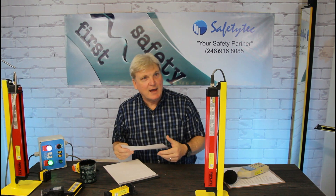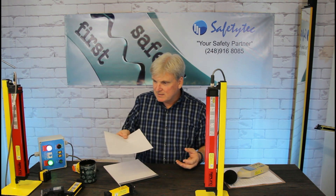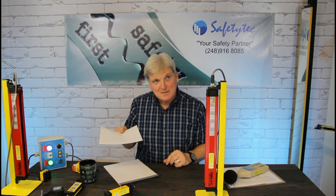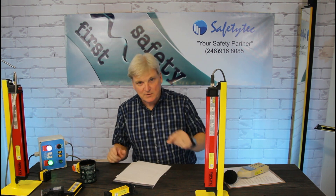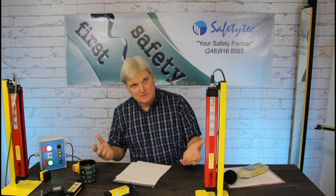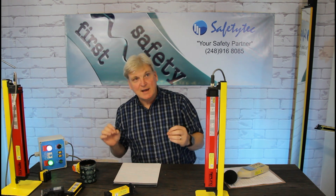This particular one is a hand guard — the beams are 38 millimeters apart. It's really difficult to put anything too thin in there. It's the only guard in the world where it doesn't make a difference what the thickness is — you're going to block a beam. This one's a hand guard from a legal standpoint, but in practicality it actually will detect anything.